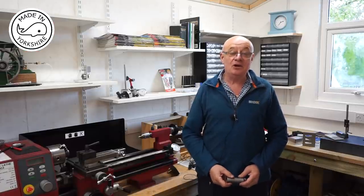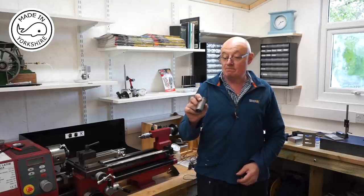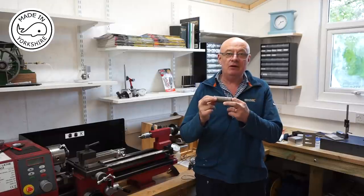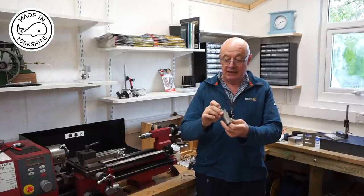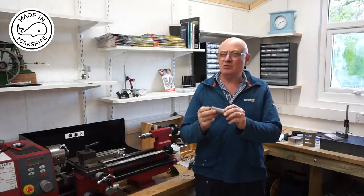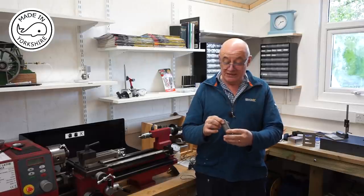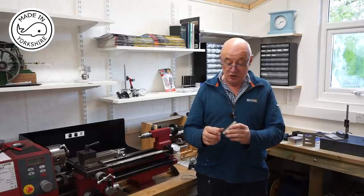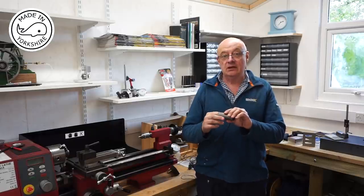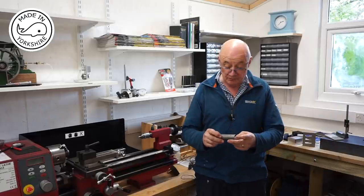Hi there. In the video when I machined the cylinder liner for the Farm Boy, I measured that it was out by about 2 thou over its overall length, and from one or two comments I received, I've come to the conclusion that that's probably not good enough. So what I've decided to do is to have a go at remachining it using a between centres boring bar.